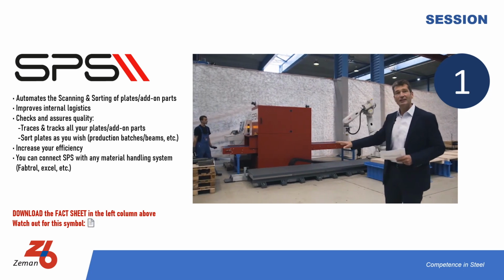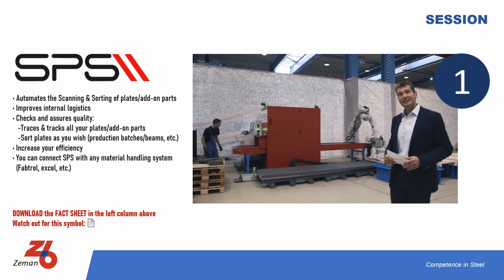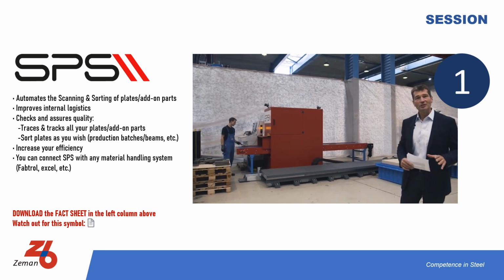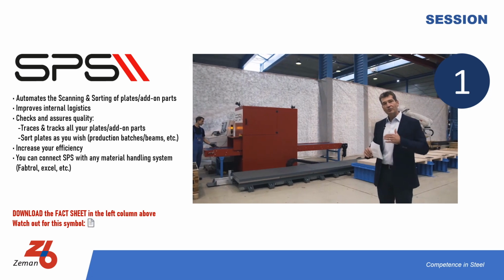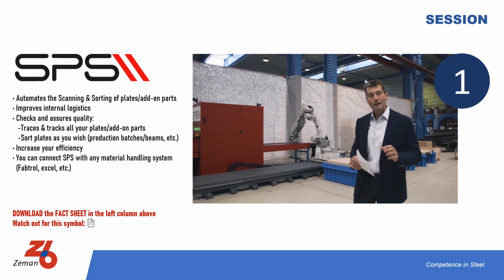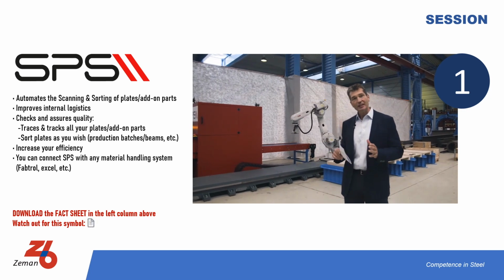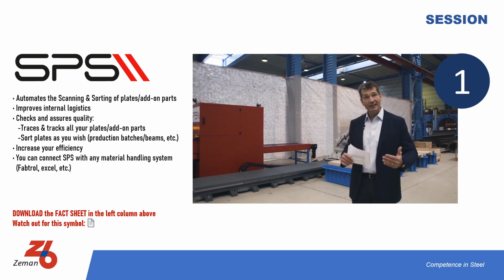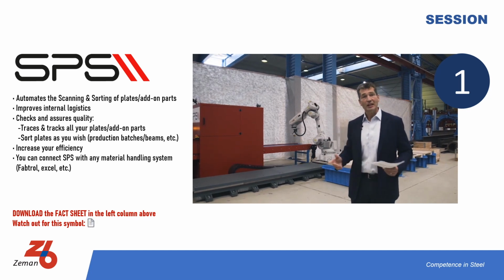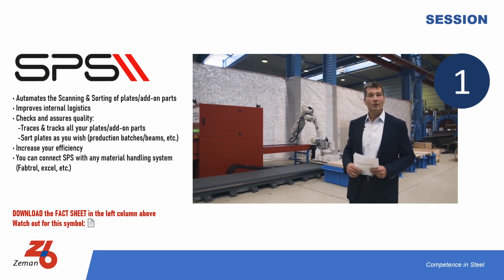We put these plates on the conveyor, scan it, and sort it to the bins. So quality check is most important, first of all. We're reading the dimension, the positions of the plate, the thickness, and simultaneously we are checking the shape, the result of our scanning, with 3D drawings, which we get from Tekla or SDS2 or Advanced Steel.